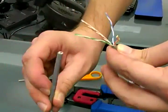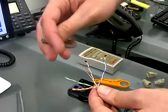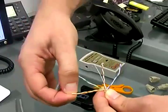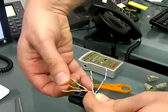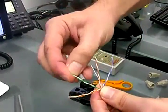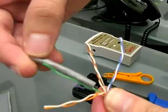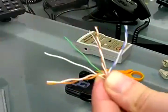You have to do the same on the other end of the cable. Now that we've spread the cables, we're going to have to untwist them. You can do it the hard way using your nails and your fingers, but it's pretty hard as you can see. The easy way is to take the cover that you just removed and put it on one wire of each pair like this and twist and turn. As you can see, the pair untwisted.